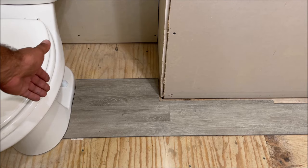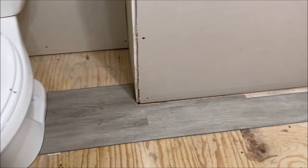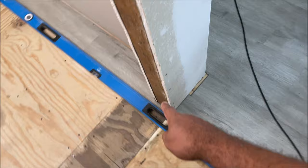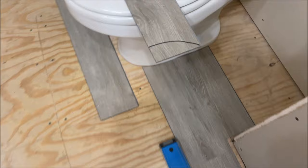The contour gauge — we got it perfect the first time. I just wanted to show that cut because trying to score a piece lengthwise it's real easy to slip and screw up your cut — try to use a saw if you can. We had that whole section pivoting on a thin piece, so I had to get a big level to make sure it's straight. When we moved it over, we changed our gaps a little bit and will have to trim back.